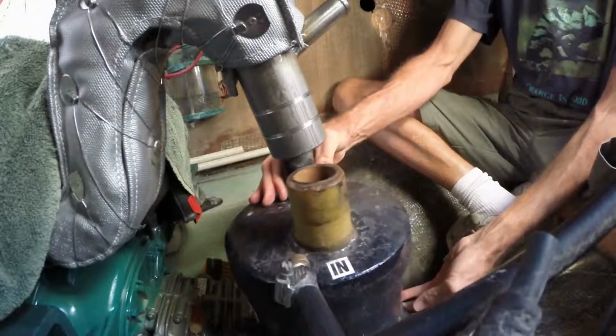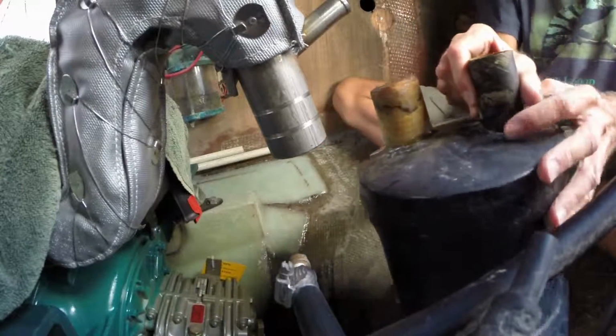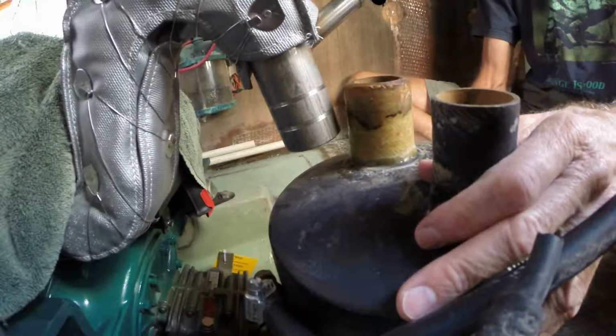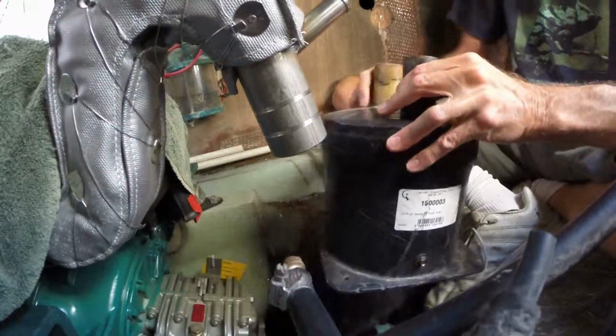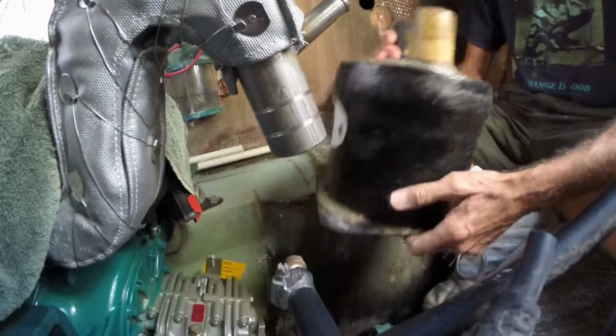Next is the water lift muffler. If I install it where it fits, it makes the shaft coupling bolts really difficult to access. Turned 180 degrees in a better location, it's too tall. So we'll just chop the thing up and modify it to fit.